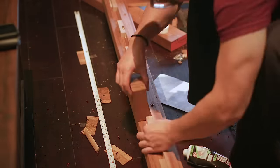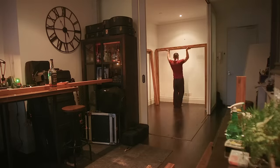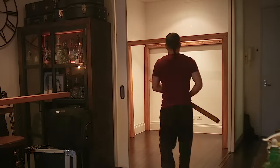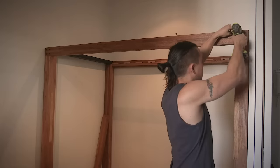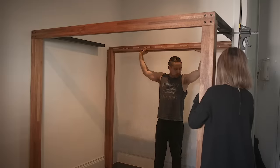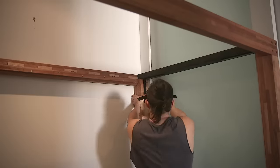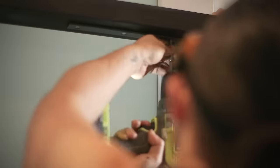Once this was done, it was time to assemble the outside frame - and these are actually a lot heavier than they look. By this time it was a little bit late for drilling, so I had to wait till the next day to bolt it all together. Of course I made sure that the legs were all at 90 degrees. I attached a set of L-shaped brackets to each of the corners to stop the whole structure from simply shearing sideways and collapsing.